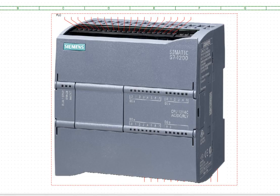Let me show you. Now take a look at here. We have 2 compartments. The first compartment, both of them are outputs. They are all DO, digital output. This first compartment is in charge of a particular set of outputs. Then here's another different compartment, in charge of another different output. They put it as DC output A and output B. Both of them are not using the same current. Maybe that is why it is separated this way. One may be bigger than the other. Maybe this one may be direct, and this one may be using a relay to interface.